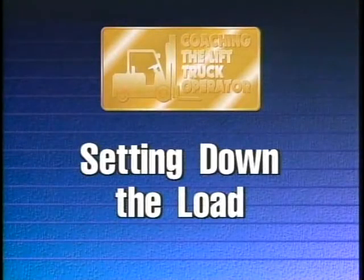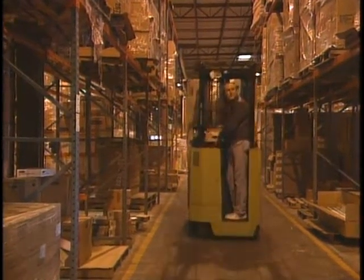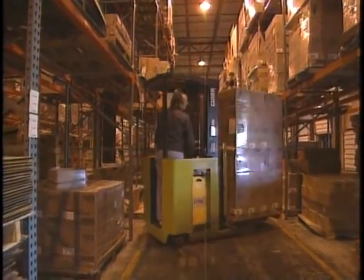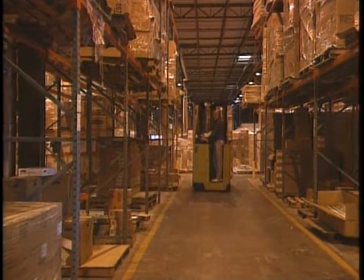Setting down the load. When you reach the area where you will be stacking the load, what are your safety considerations? Let's watch this operator. Note that he stops the truck and scans the area, especially the area above. And the area where he intends to place the load — in this case a storage rack — must safely carry the weight of the load. Despite safety reminders about sprinkler systems, they continue to be mentioned in accident reports. Watch out for the sprinkler system, heaters, or any other overhead obstructions, making sure you maintain adequate clearances.